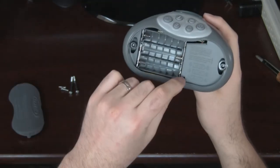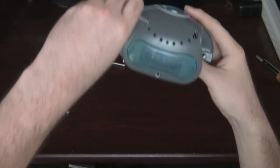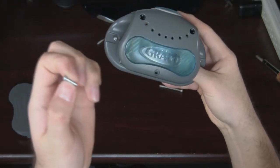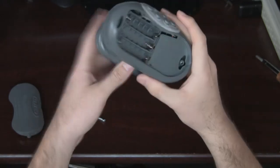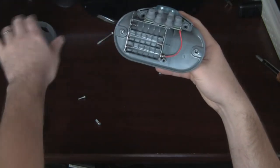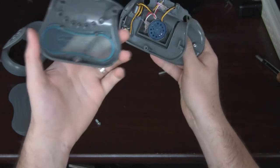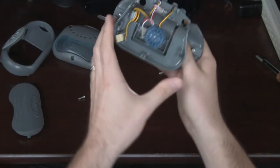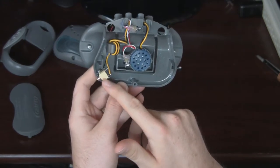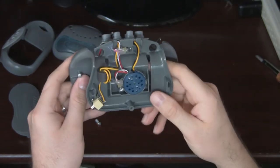I already took the time — there's a screw here and then three screws here. The top ones are longer screws and the bottom one is a shorter screw. This piece will come off. Put that off to the side, and then you have another one here — this side comes off as well. And what you have left is a speaker, the output to the motor, the music box with the speaker, and LEDs here.